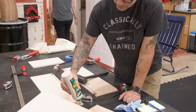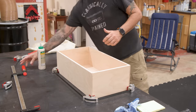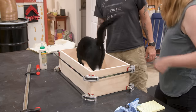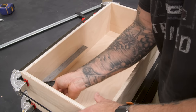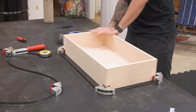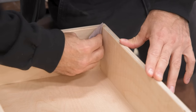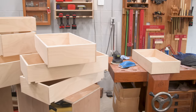Time for some assembly. Corner clamps are now my new favorite way to glue up rabbeted drawers — no more crisscrossing clamps or resulting gaps. This was Jay's idea, so thanks Jay. Sanding the inside corners where the glue was cleaned up is a breeze with backside sandpaper. The outsides are then cleaned up with some sanding as well. We got some drawers. Now I can attach the locking mechanisms to the underside of the drawers.